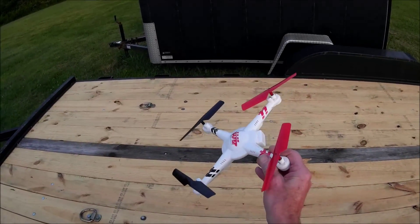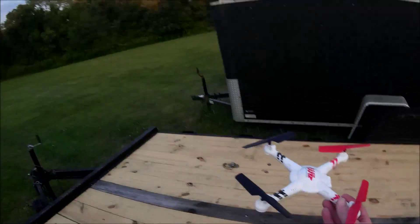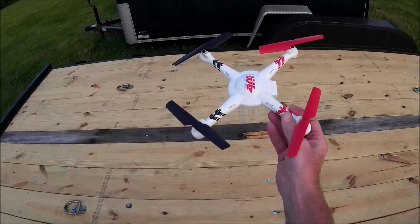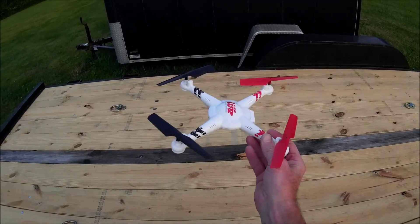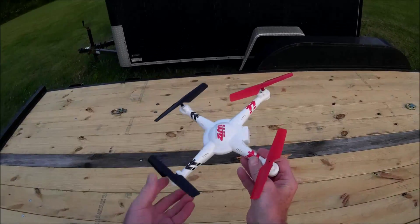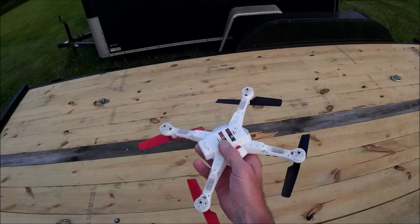I really wasn't pleased with that either. The FPV camera will dropout around 100 meters or so. What I'm going to do is get some cloverleaf antennas for the transmitter on the camera and the receiver, and see if I can't cure that issue. Now let me talk about the mods I did here.